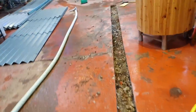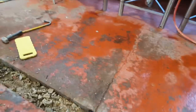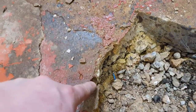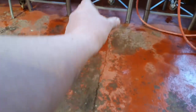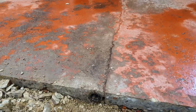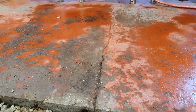We're also going to come up here and terminate up at the top — all the floor runs down into the centre anyway. There has been some repair work in the past; as you can see somebody's tried to send some cables and whatnot through there. They were dead — you can see where they were cut off. So nothing to worry about. But this section here has been dug out at some point and then just buttered over the top — not a very good job. We may remedy that before we put the resin flooring down. At the very least we'll sort that crack out.